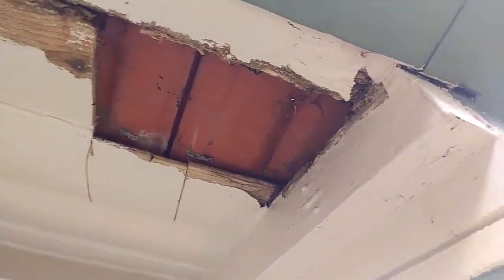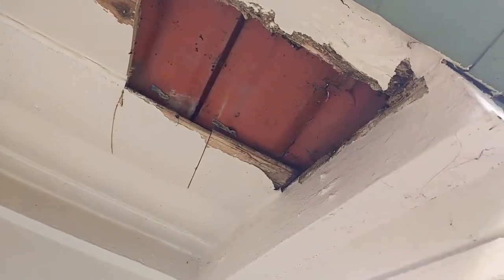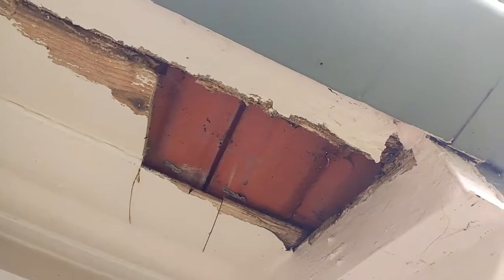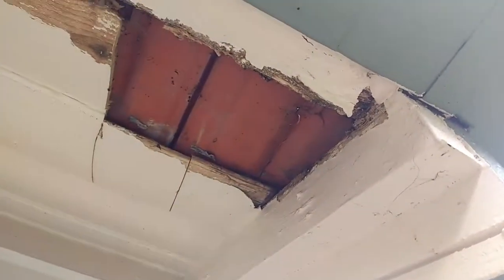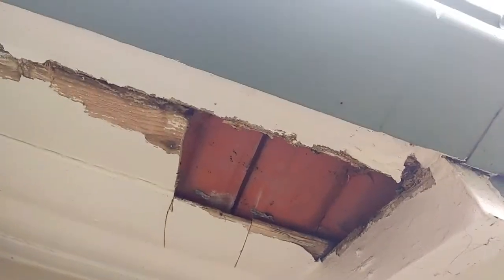This pretty much demonstrates why you shouldn't be caulking under the eaves, because if some gaps had been left open, then at the very least it would have been visible over time that streaks were coming down and water was getting in somewhere, and they would have been able to find that broken tile. Now a fair bit of repair has to be done as a result of not being able to see beforehand. Also, if it had been more open, it may have had a chance to dry out better and not start rotting even before they realised this was happening.